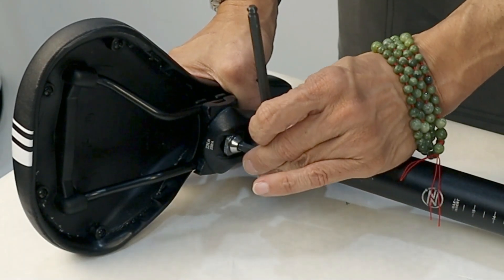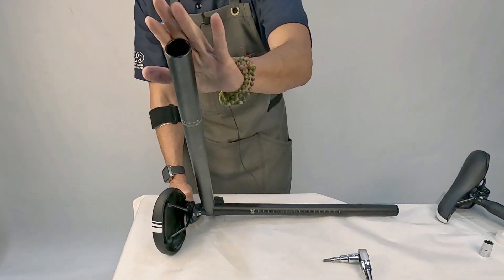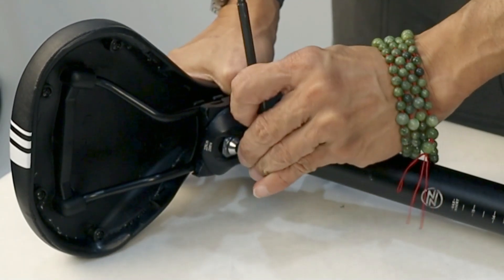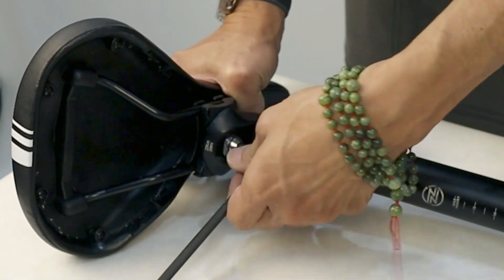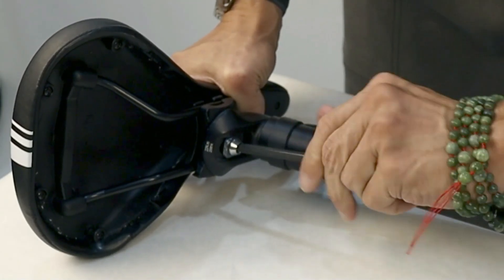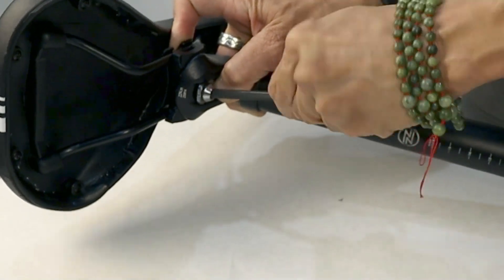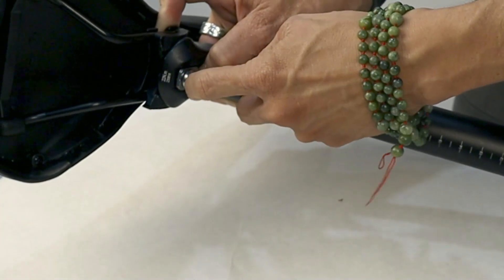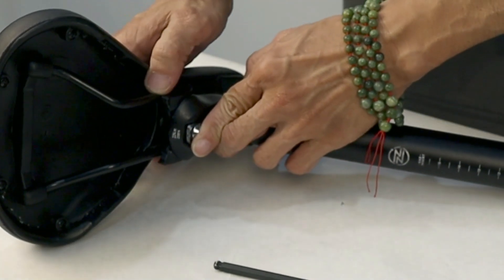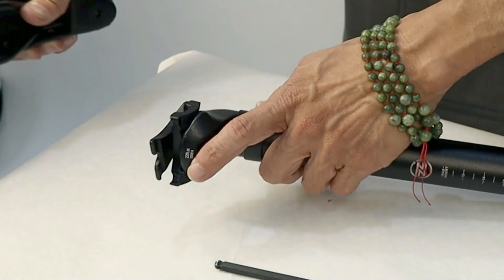Once you've gotten it loose, you should just be able to turn it by hand. We're going to use that leverage and loosen it like that. Hopefully we've got it loose enough that we can do it by hand now — yeah. Then we just turn it by hand until it becomes loose. You don't need to remove that plate; you'll notice I'm pushing down on that plate, keeping it in place, and the bolt is actually extending out. Once you've got a few turns, you just push on that bolt and rotate that plate out of the way. Then you can slide that saddle out.